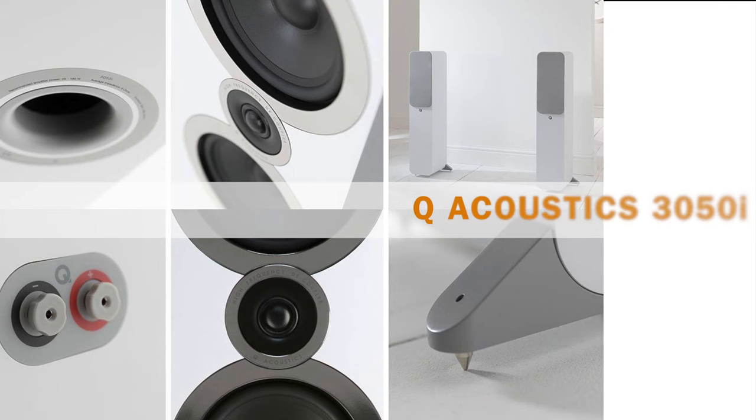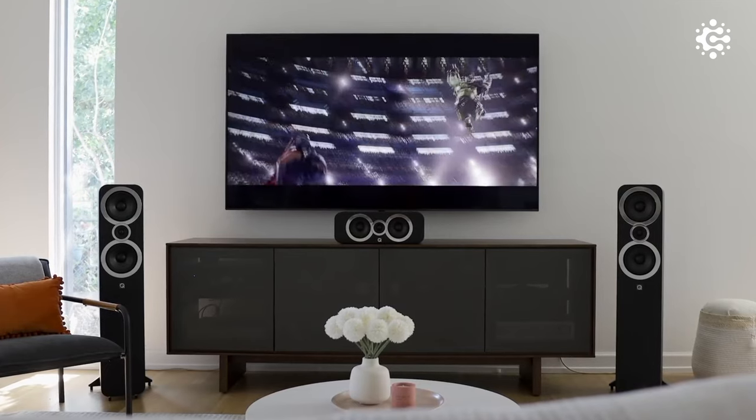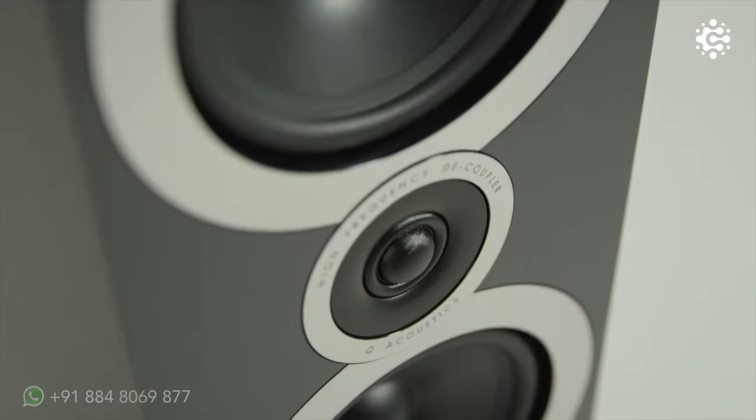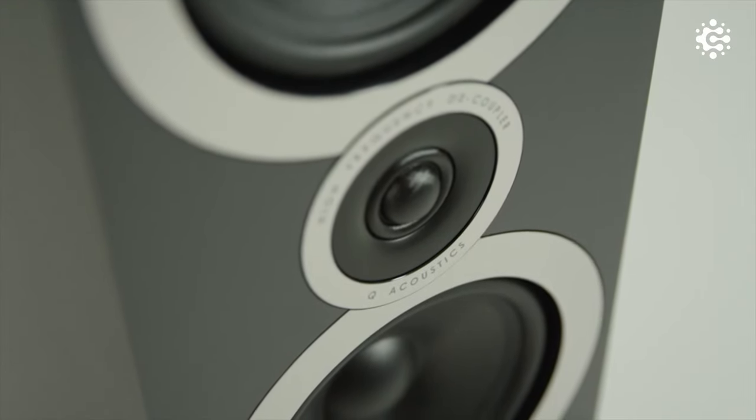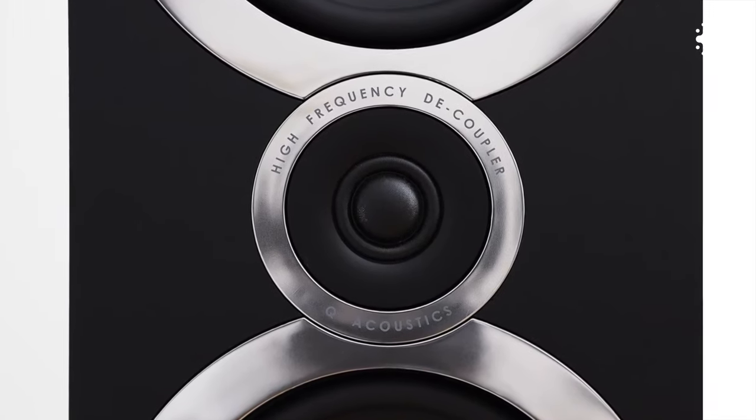With these two technologies, these speakers excel in stereo imaging, paired with a wide sound range. There are commonalities across all speakers in this series. Firstly, the driver design is two-way bass reflex. 22mm tweeters are used, which use coated paper — and because of that, it can have a harsh sounding tendency. The tweeter has a compliant suspension and behaves as an independent unit, performing well despite driver vibrations.